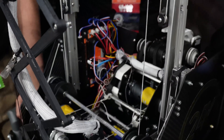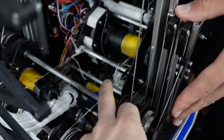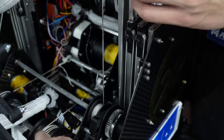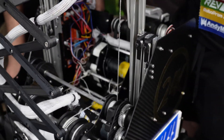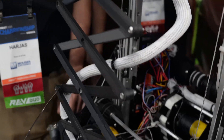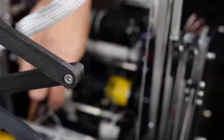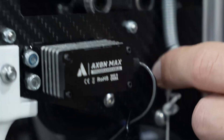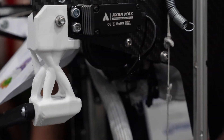Without it, the cable would fall into the robot during retraction. Instead of springs for retraction string tensioning, they use zip ties. Springs caused problems — if the extension snagged, the spring would stretch and the spool would continue unwinding, hopping the string off. The spools were made intentionally very wide so the string doesn't wrap over itself and change diameter, eliminating the need for a spring. Zip ties allow easy tension adjustment as the nylon string stretches over time — you simply coil the loops to change the effective length.